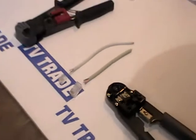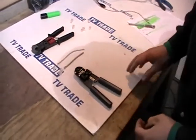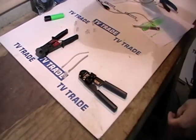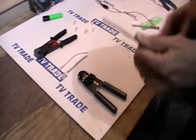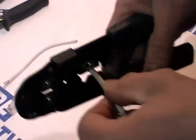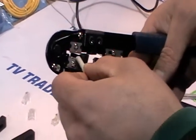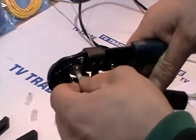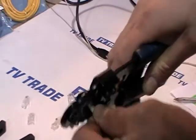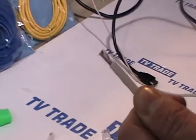What I'm going to show now is how to use this tool with the RJ45 and then also with an RJ11. We pick up the tool like this, and use this snip to cut off the end of the cable and give us an even, smooth cut. Then we push the cable through here, and there's a stopper on the far end which gives us exactly the right length of cable.